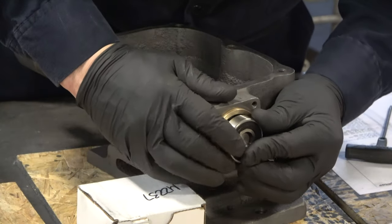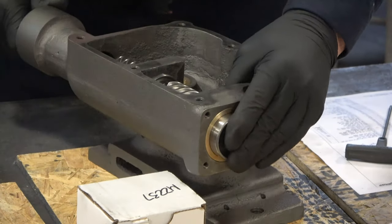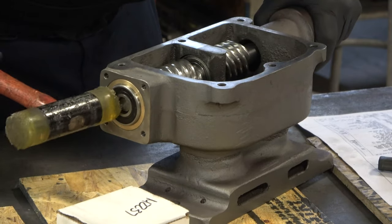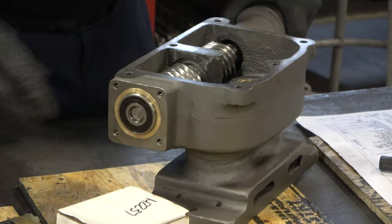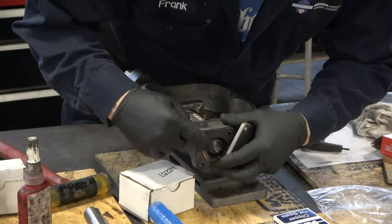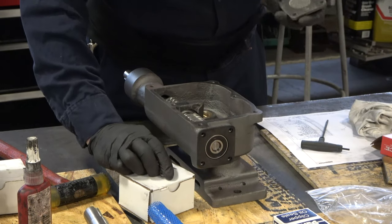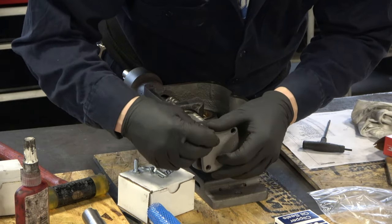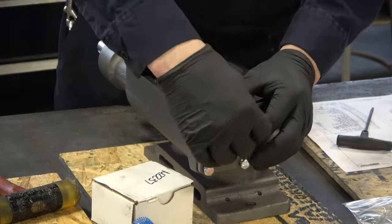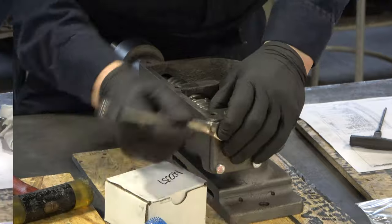At this point, the bearing must be seated inside the adapter. This can be done by gently tapping on it with a plastic mallet. When you feel the bearing bottom out against the back adapter piece, stop. At this point, the shaft is properly located. You can then install the gasket and the end cover on that side of the housing. Note that the gasket should be flush with the outside of the bearing, and the end cover just keeps those in place. There are four 1/4-20 screws that you will tighten with your 7/16th wrench; the gasket will expand slightly, but this is no problem.